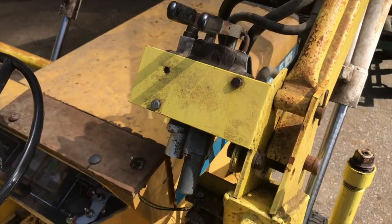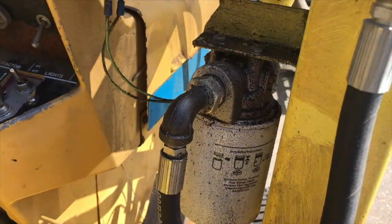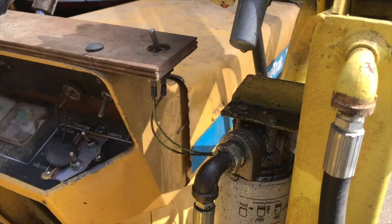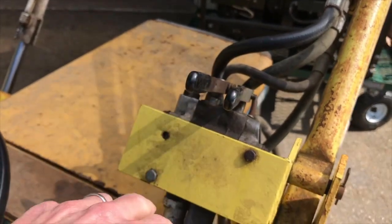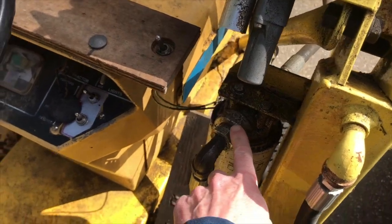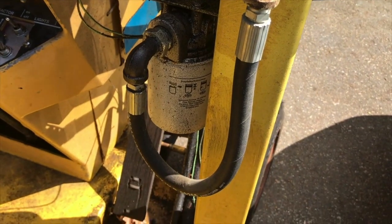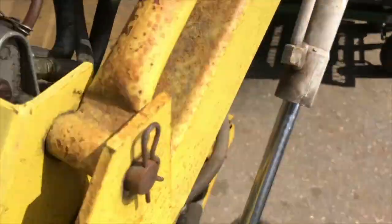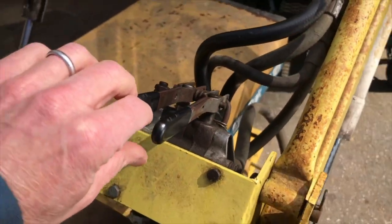Notice also there's something that looks like an oil filter down here. As the oil comes out of the valve, any oil that isn't used to move the machines gets recirculated, so that hydraulic fluid goes through the filter to keep tiny particles from getting suspended in the fluid. Those tiny particles can mess up the seals and can mess up the valves for controlling positions.